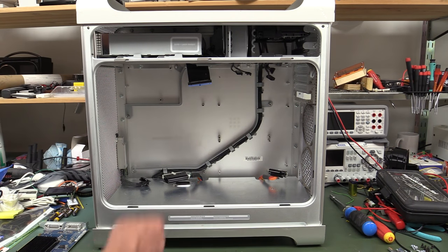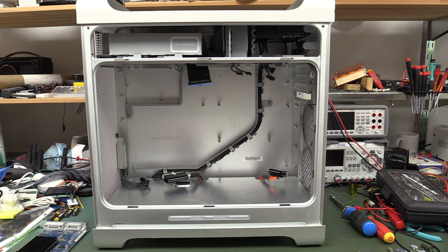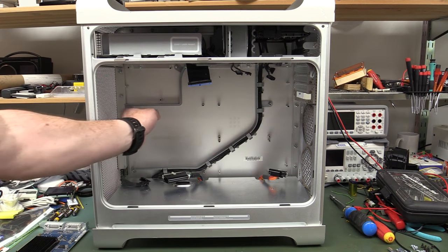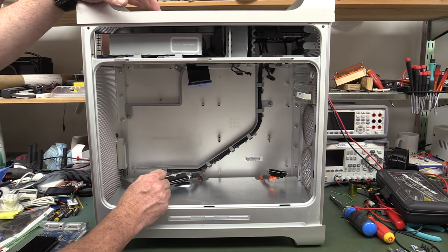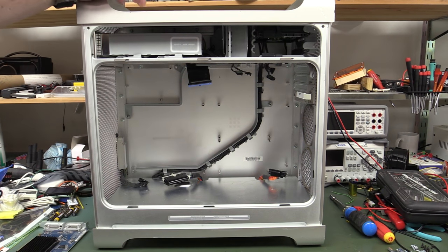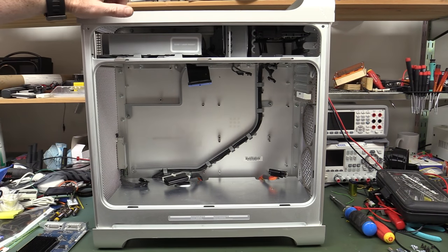I mean, now all we've got to do is get there and measure all the dimensions of everything. You can either work from the standoffs on here or work from the board. It's probably easier to work from the board, rather than try and get a big metal rule in here and it doesn't fit for these standoffs. You can get them all from the PCB, and we can do the slots in there for those ones where it slides in and gets hold of that. Or you don't have to even put those in if you don't want to. If you don't want to get fancy pantsy, you can just make a big cutout hole for those things. And, well, I don't know, we're not going to hook drives or anything like that up, but we could if we really wanted to.